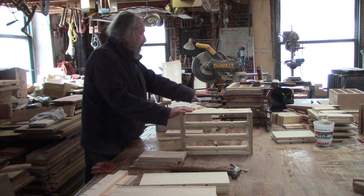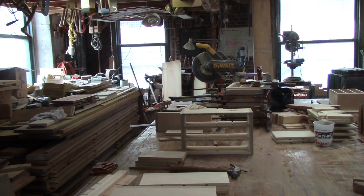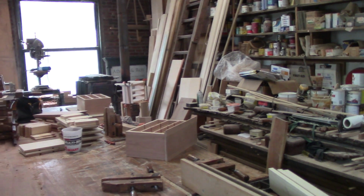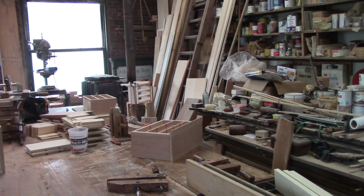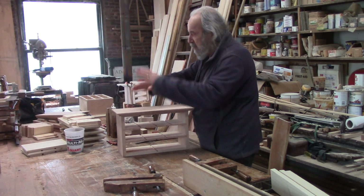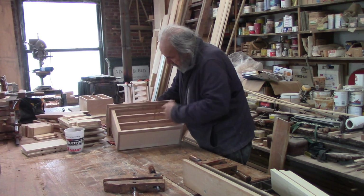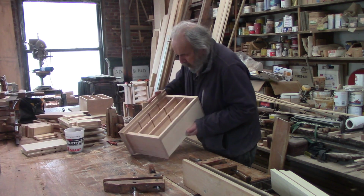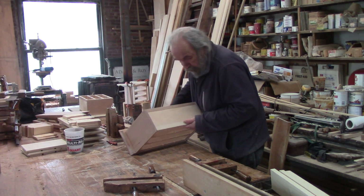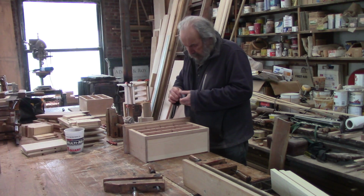I've got 2 more right here. I've got 1 that I put a top on. I'm working on. Let me swing you around. And we'll go to there. We're in sequence, right? We do a couple of those and move on, do a couple of these. So I just put some tops on yesterday before I left. And this is that. Got a little bit of glue ooze out in the joint. And I've been cleaning it up, pretty much got it. I want to do a little teeny bit of sanding right in the crease, just to be sure that I've got it all.